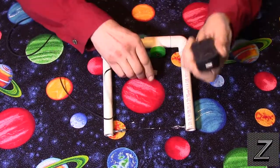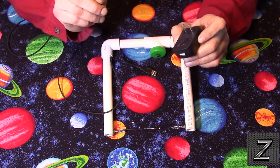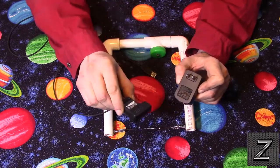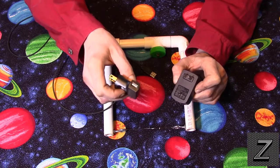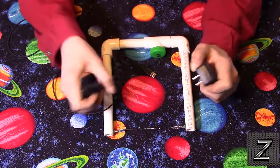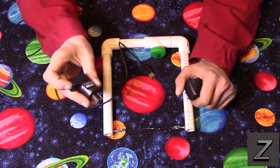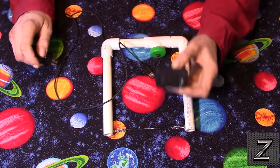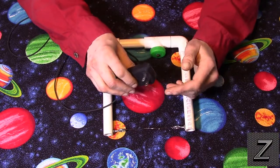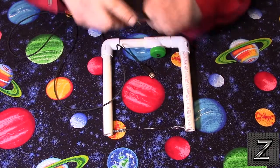First thing you are going to need is one of these USB wall plugs, and you're going to want to make sure it is a 1000 milliamp. I did try a 700 milliamp that I also had. I do believe that's this one right here. It would heat up and cut, but it was really slow and you had to kind of push on it. It did work, but not very good. What you could do is, I have a 4-inch cutting gap here. If you narrowed this down to about 2 to 3 inches, you could probably get away with the 700 milliamp, but I would go for one of these 1000. That is the ticket, and don't go much over that. I'm pretty sure you could probably go to like a 1200 and be fine, but try to stick with a 1000 milliamp USB phone charger wall plug.